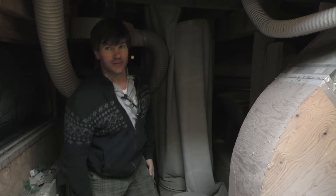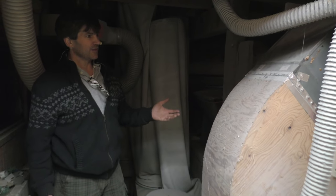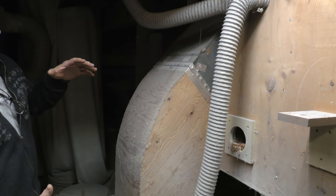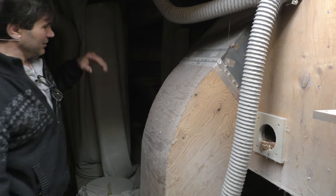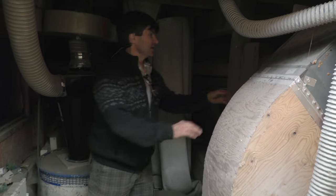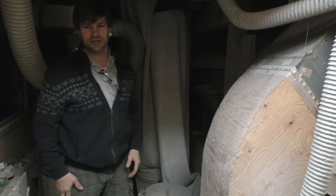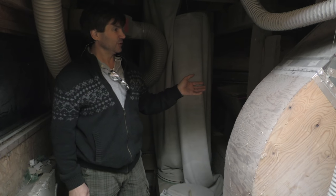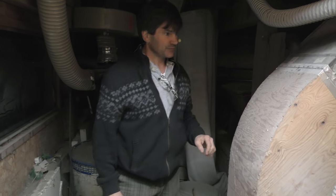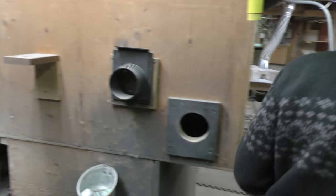A phone? I bought a blower that came out of a restaurant, and the opening on the blower is 18 inches, so it's a really large impeller. It's got a 5-horsepower motor. The strange thing is there are two pillow blocks on there that have no grease nipples, and in 30 years of running I've never put a bit of lubrication in there, and the thing still runs nice and smooth, so go figure that one.